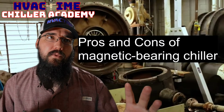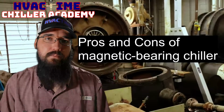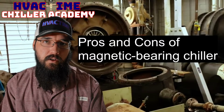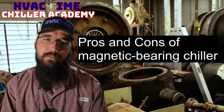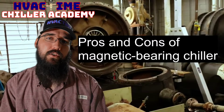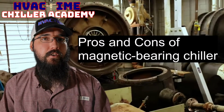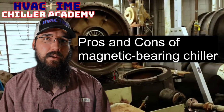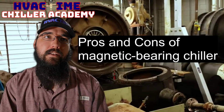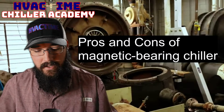Now, the big difference you have from going low speed to high speed is just the size of the compressor. With a high speed, you can use a smaller impeller. The whole package becomes much smaller in size to move that refrigerant. Versus with a low speed, you need a much larger impeller and system in order to get the same energy added to the refrigerant to create the lift and such we need.